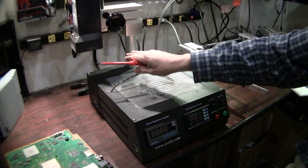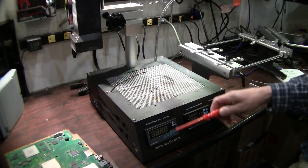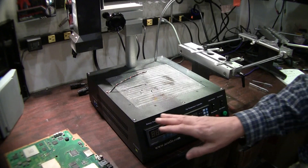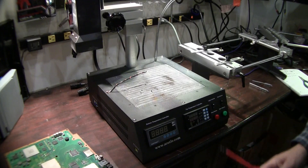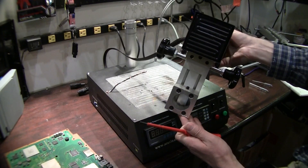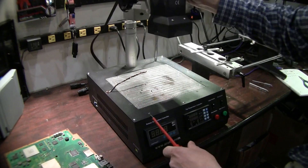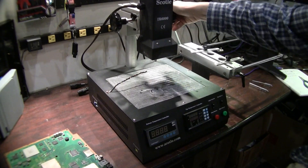When we put our rack on there, our board is sitting just above that sensor. What that does — modifying your lower probe — is it allows your bottom temperature controller to pretty much control the temperature of the board almost the same. So when you set this to 180, your board can go to 180. If you use it the way it comes from the factory, you could set the unit to 200 and the board may only get to 140 or 160 degrees. Now the upper head is your typical small IR plate unit. This is a 220 volt unit so it needs an adapter, and it uses a lug to kind of latch itself into place. It has an adjustable height for your IR.